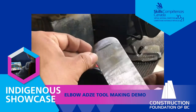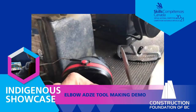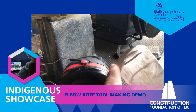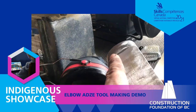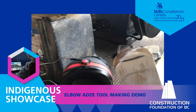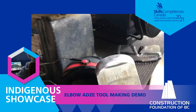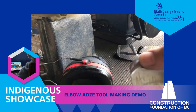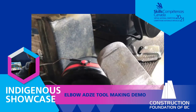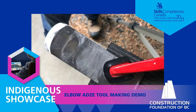You can see I've started putting the bevel side of the blade on — it's gone down to a nice thickness that I can actually move to the files. I'll do a few passes with the files, get it nice and flat across that bevel where the blade is, and then move on to some sharpening stones. Just like with the diamond stones, you want to bring this to a really nice high polish to get a clean, sharp adze blade.